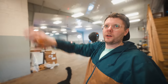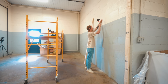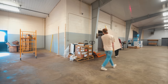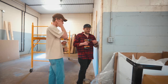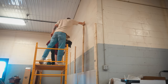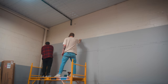The plan was to attach two-by-fours to the brick wall to build our green screen on top of. We used the Tapcon drill bit to get through the masonry, and Tapcon screws to attach the wood to the cinder blocks. This drill officially makes the most annoying sound of all time. We put up one piece of drywall just to idiot-proof ourselves and make sure we're doing it right. We got our first piece up and it looked fine — then a lot more wood, a lot more drilling, a lot more Tapcons, and we got the wall finished with the rest of the drywall laid out. It went a lot better than I was expecting.